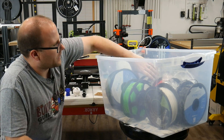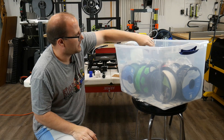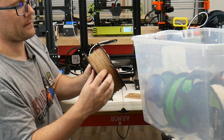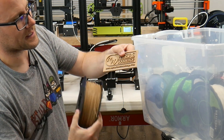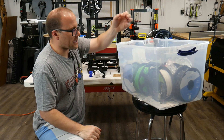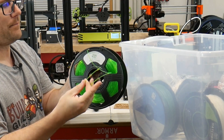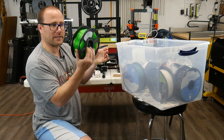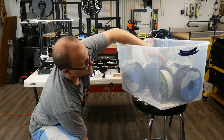I leave them in their plastic — they come with silica packets and vacuum sealed. I leave them in there until I'm ready to use it so I know it's fresh. There are some really cool kinds like this wood filament, which feels different than plastic and prints really nice. It is stainable and sandable — about 70% plastic and 30% wood. You also have many thousands of colors. This one is a flexible filament — it feels kind of gummy when you touch it, and when it prints it'll be a solid object but you'll be able to flex it, like a snake. Not all printers can print this, but the higher quality ones can and the Ender can.